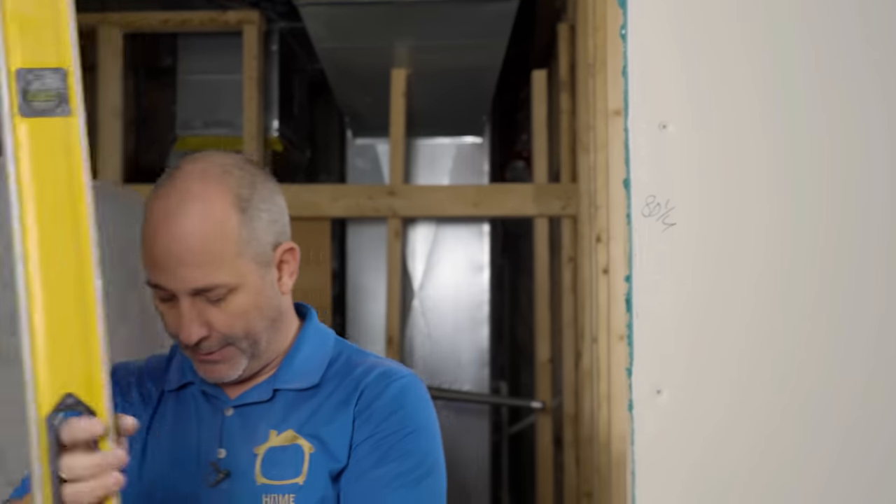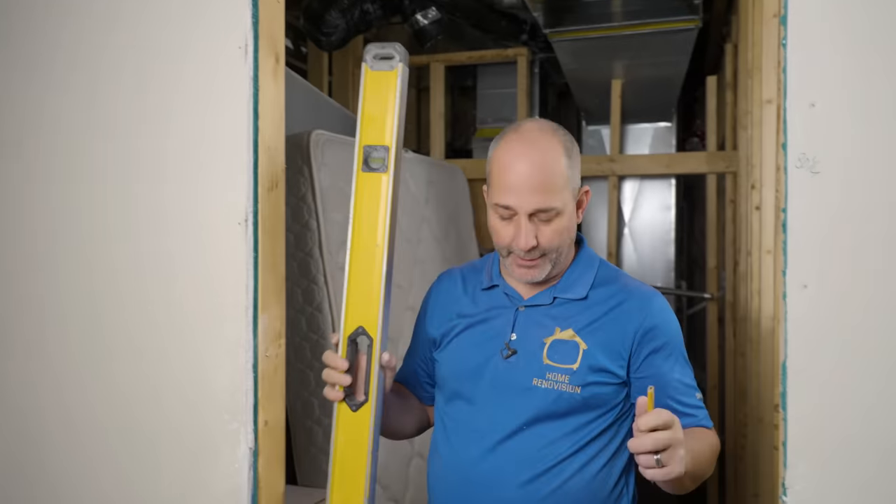Because I have a 28-inch door with jams, my full width is 29 and a half — it's not a lot of wiggle room. So I want to throw a level on this thing and just make sure that I'm not 30, 30, and 30. You could use a laser level if you have it. Somebody built this thing paying attention and used a level, so we're going to be good.